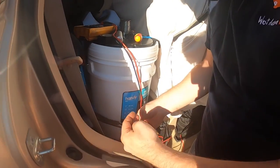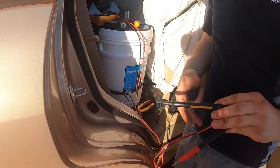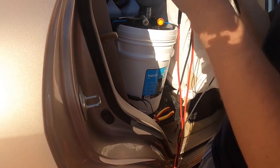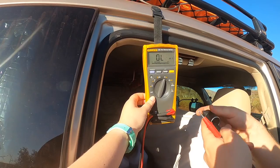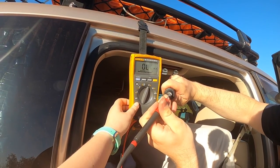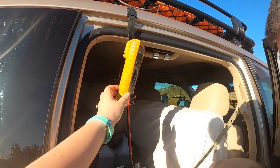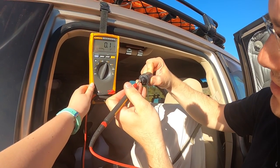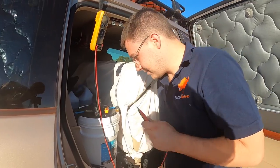Because this was all insulated, it's a bit hard to tell which wire is which. What you can do is use the meter — go to the center pin in the plug, meter on ohms, tap one wire and we've got nothing, then tap the black wire — okay, so black looks like it's positive. Then go to the outside, touch white — there we go, white shows continuity, black does not. So white is negative, black is positive, which a lot of people would think otherwise.